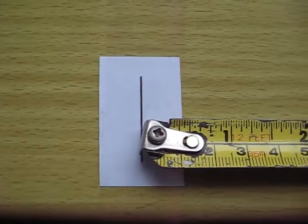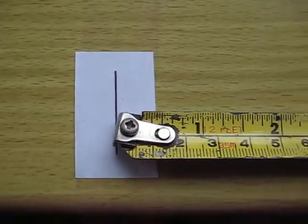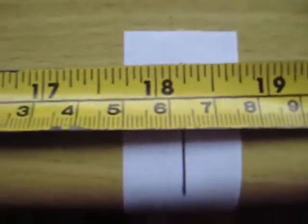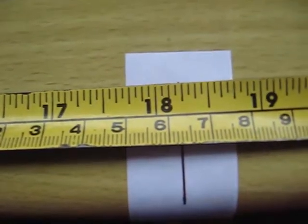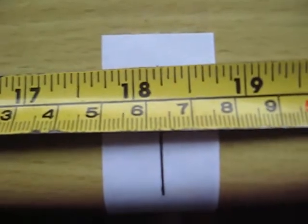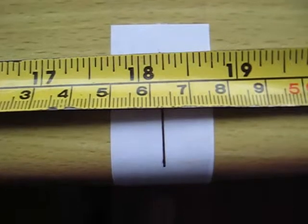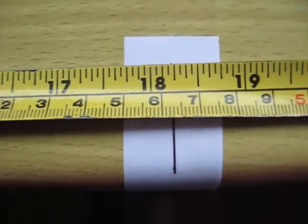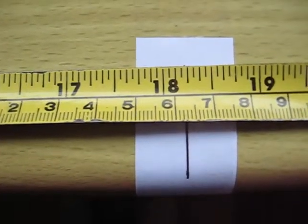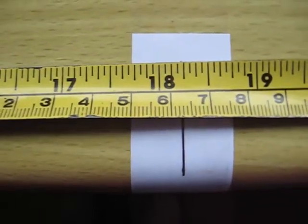I have made a marker on a flat surface. That is the beginning on my rough tape. There is 463 millimeters for one of the coil sections. I have divided that half wavelength into three, and I am going to mark each third separately so the line-up and the coil is perfect.